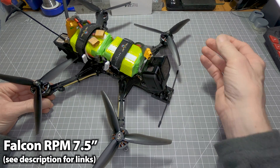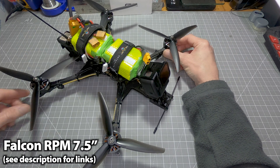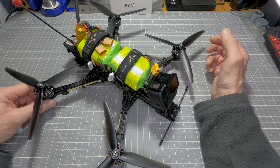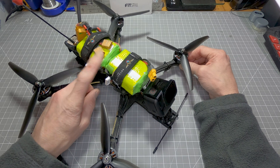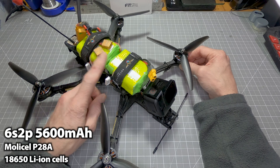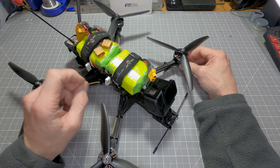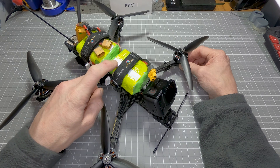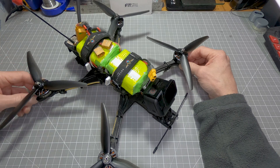Last week I went over the video system and talked a bit about the drone, but one of the things I didn't talk about was the control link — my Crossfire and transmitter. Also, this week I'm using different batteries because this flight is a longer one. I'm using two 18650 6S packs made out of Molicel P28A cells — 2800 milliamp hours each pack, for a total of 5600 milliamp hours at 6S voltage.